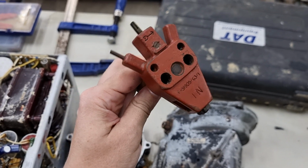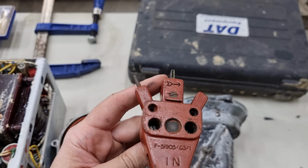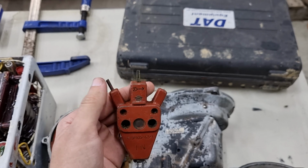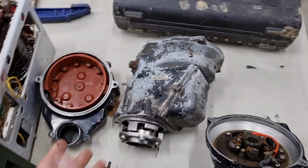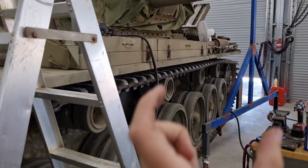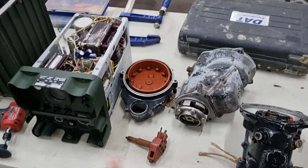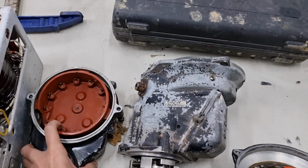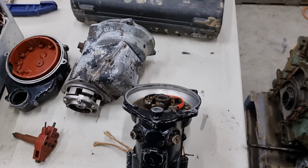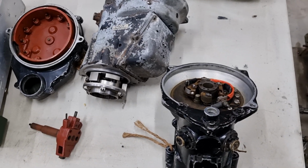So it always follows in this motion. That's your main electrode, so that's the one that you're always sparking out of. But when you use the booster coil, it pushes a spark straight through the middle and out onto this one here. In this climate, we don't use them. It is fitted to the tank. It's just a little thing about yay big. I'll probably show you anyway in a second. But we don't bother hooking them up, just because it can mess with the starting a little bit, and we want to make sure that it's starting without the assistance of the booster.